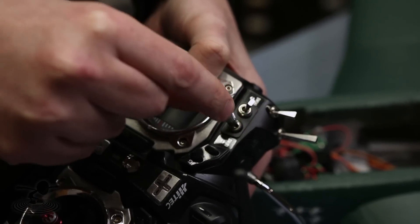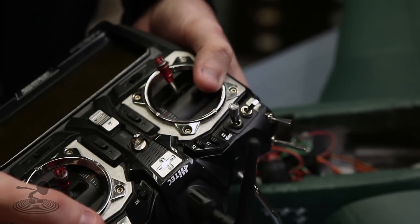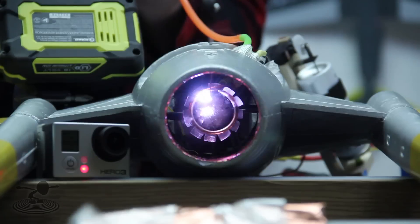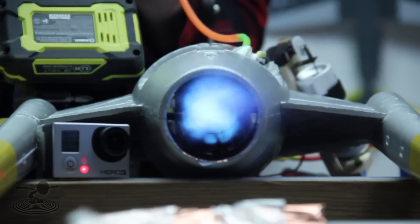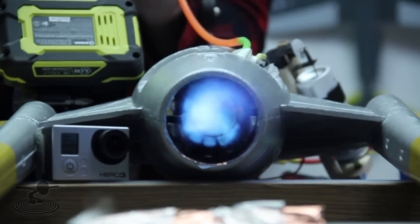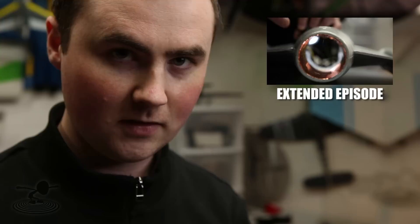I have a safety switch — this has to be in the active position. Then I have a three-position switch: off, both the gas and stun gun activated, and then just gas. Because we don't want to fire the stun gun unnecessarily throughout the flight, as that can lead to interference and it actually wears down the stun gun unnecessarily.